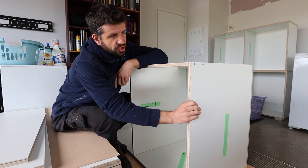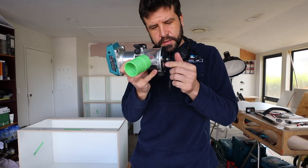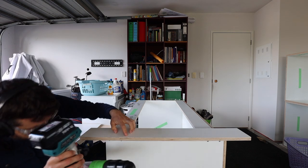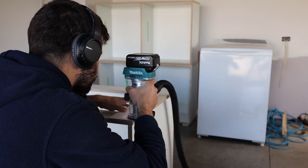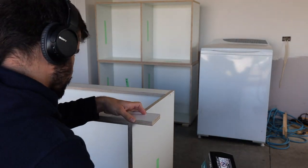We're doing exposed plywood edges. Let's try and finish these edges and see how it goes. The issue is it's going to show — you're going to have a dark gray and then this light blonde wood color. I'm really happy with how that turned out. Sanding it back a bit gives it a nice soft edge. Feels way better and it's not showing too much of the timber when you look at it from this angle.